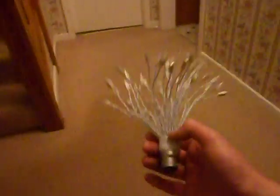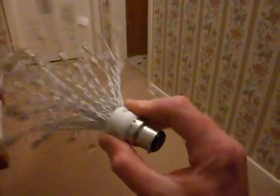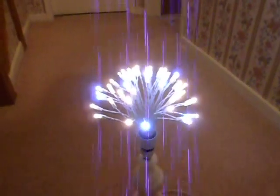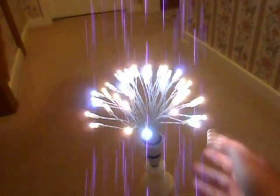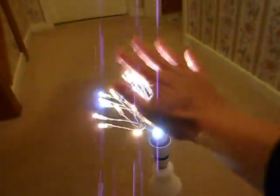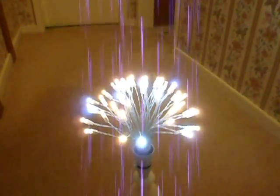Then I got really greedy and decided to fit as many LEDs as I could into the smallest base possible. I got a compact fluorescent base salvaged from an existing lamp and crammed 50 LEDs in series into it, again in Molex connectors. These are a mixture of warm and cold white. The camera isn't thrilled at the sheer amount of light, but this looks fantastic. You can swap the LEDs again — with the power off — because the thing is kind of live if you pull the LEDs out and expose the pins.